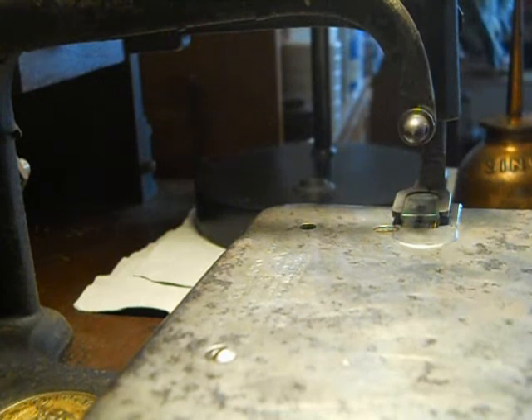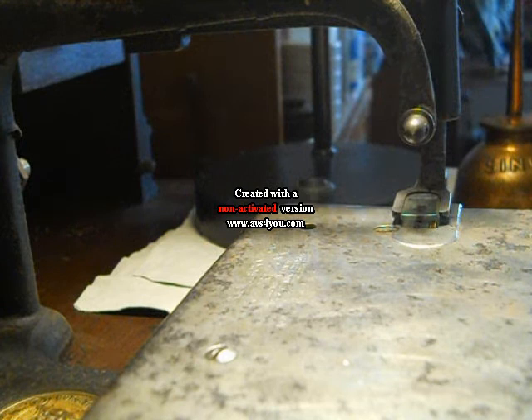There's a point where the belt has just, for some reason, stopped. What I can do is mark the belt with chalk, and then when I'm not trying to treadle it, I can try to shave the belt in that area. I'll use a single-edge razor blade or something and just shave a little bit of the belt off, and see if I can get it to go through a little bit more smoothly.